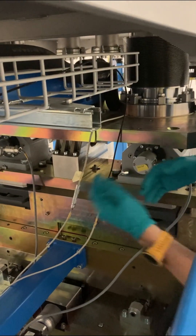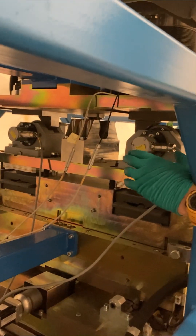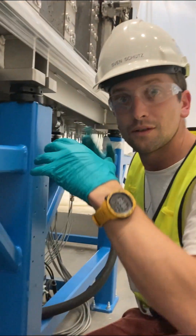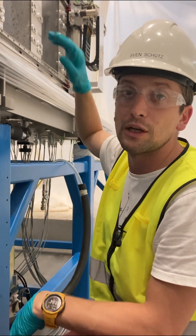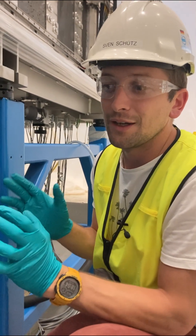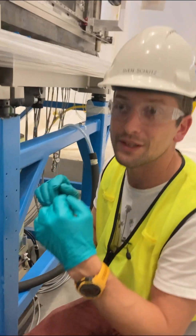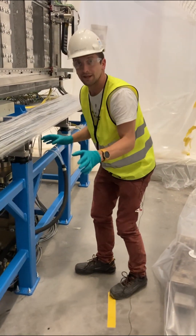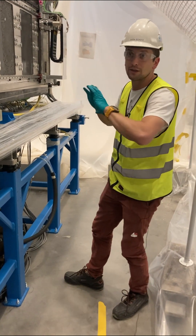You could ask why we separated this and put it out to the sides. This is done because with this setup we can make a kinematic mount having four vacuum feed-through pillars, which introduce the load to the base plate at the exact same position for every position below the carrier. That gives us a more simple structural situation, which is better controllable and with which we expect better results. Those feet are then meant to adjust the carrier to the position needed in a global setting.